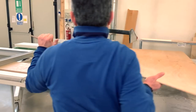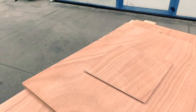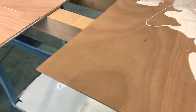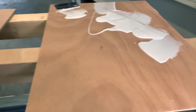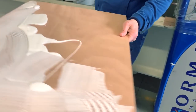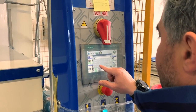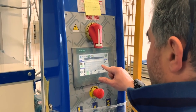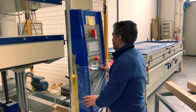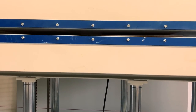Coming back at the Top Tech workshop, me and Franco cut the plywood, but we didn't have the correct size. So we used thin plywood and after that we put it all in the press together to get the correct size and thickness to make the new chart table. You can see Franco gluing in this moment, and after that we will put all the stuff under the press. We give a ton of pressure and in a couple of hours my new plywood will be ready. When you don't have the correct stuff, you make it.